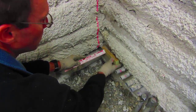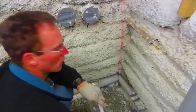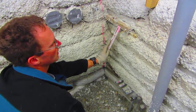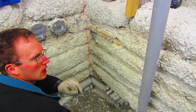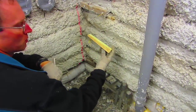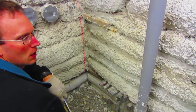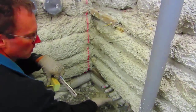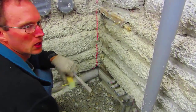What are you doing? Well, here I'm using a laser level so I can flatten these walls, make everything nice and smooth and vertical. These Velcro plates went in as we were putting the different layers of bags in place. They're not always going to be perfectly plumb and level when you put them in, so here I'm making some adjustments. You'll see this board is making up for the angle of the wood here in the wall, and this will make everything look nice and plumb when everything's finished. All this here is going to be the electrical pipes going into the electrical panels in this corner as well.